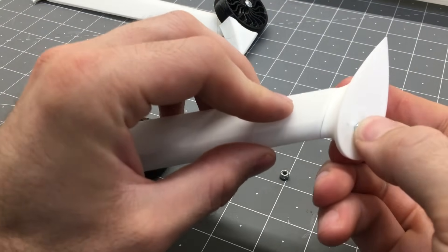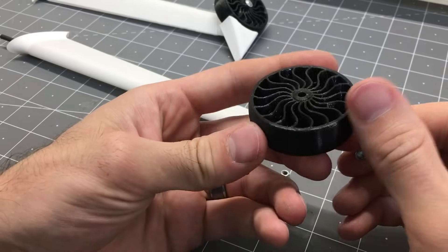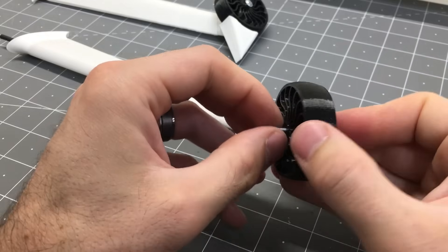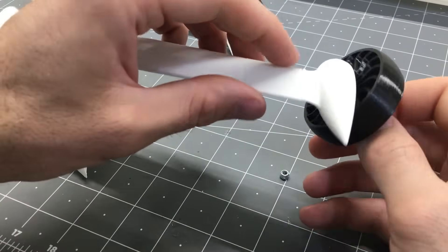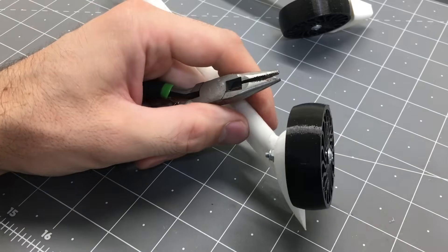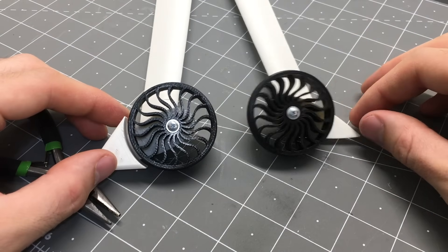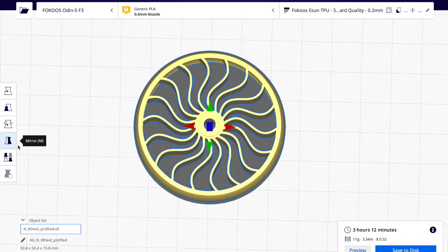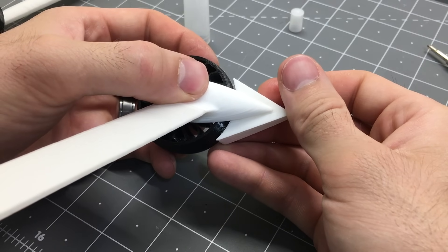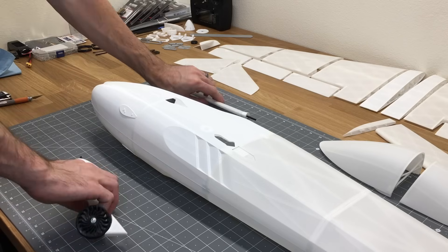Add 3mm nuts — a regular nut on the lower part. The tire has a small lip that faces the fitting to act as a spacer between the wheel and fitting. Screw that into the regular 3mm nut, then use a 3mm nylon lock nut on the back side, tightened down slightly. The wheel spokes face opposite directions since only one STL file is provided, so I mirrored it in Cura so both wheels roll in the forward direction on the spokes — just an aesthetic choice.